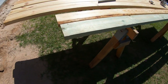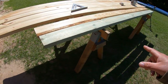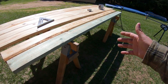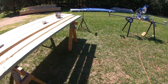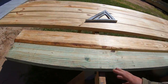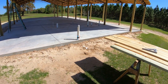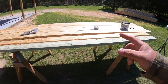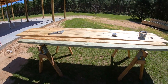I'd much rather put an extra 2x6 every so often than rip sheet after sheet of sheathing — longer cuts, hard to keep straight, aggravating. It's actually a little cheaper right now. This wall winds up with maybe one extra 2x6; the next wall maybe two, so that $300 figure may be more like a couple hundred. Ultimately I wind up with a stronger wall — more 2x6s, sheathing locking the post to the wall. I do not mind overbuilding.